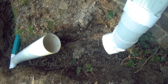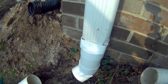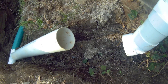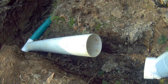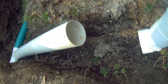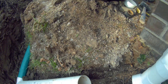More importantly, PVC is also good for pushing debris out. Understand that a gutter is an entry point for debris into your drainage system, so anything we can do to push the debris out — either into a catch basin or in this case into a sump area — we definitely want to do that. Using PVC pipe allows that to be done. With corrugated pipe, you just don't get good debris push-out.